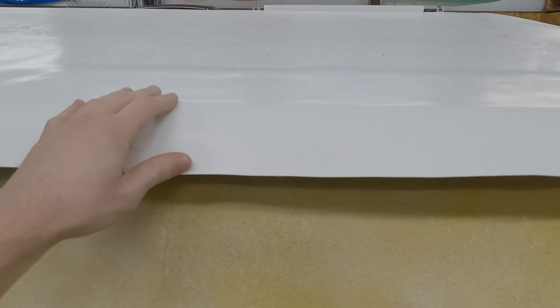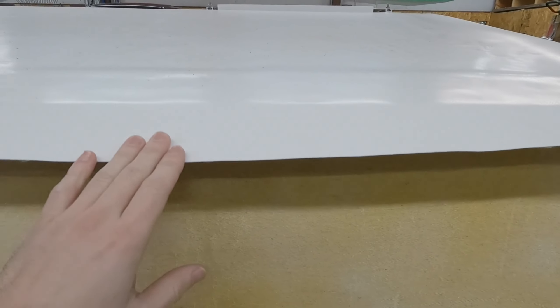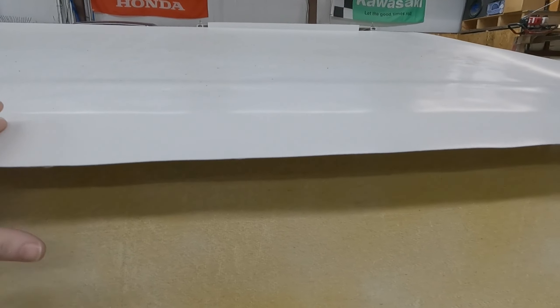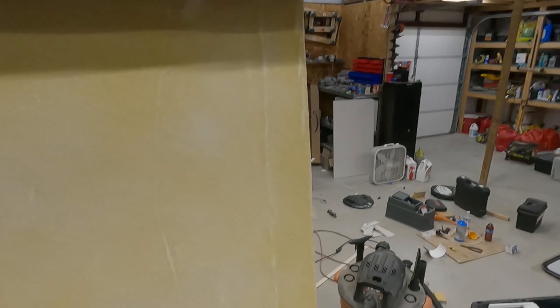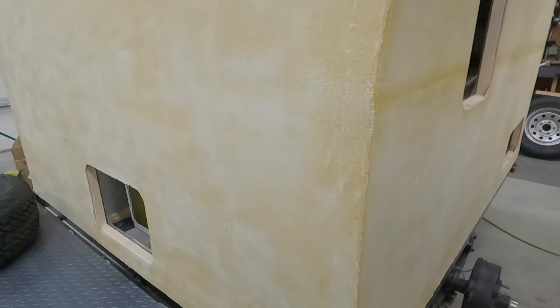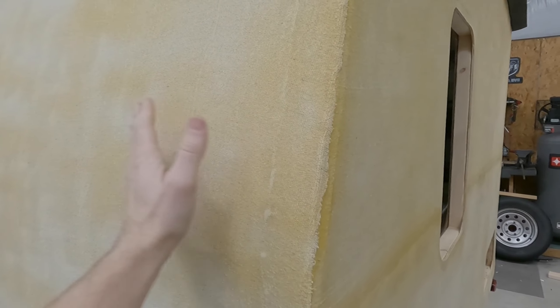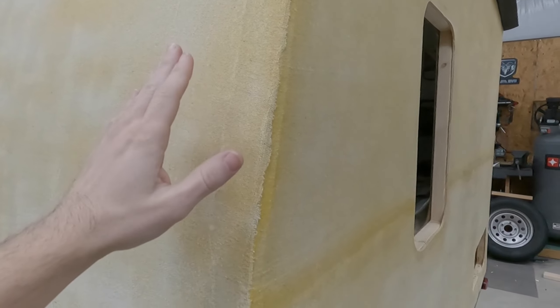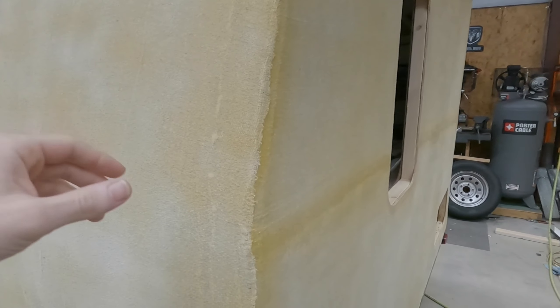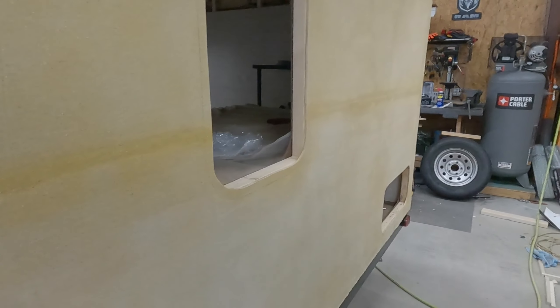I cut this - this is not how it's going to be. I've got it just probably three or four inches longer, so it's overhanging the sides. When I get the trim, I'll actually figure out how much of this I'm going to use and cut it. The front was the last one that I did, and I had to do it last because again I wanted this to lap over and then the front to come up to the edge, because the water could potentially be blasting it here and you want it to work its way back.